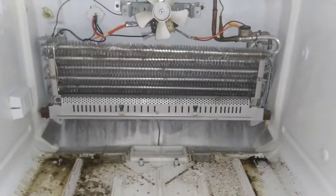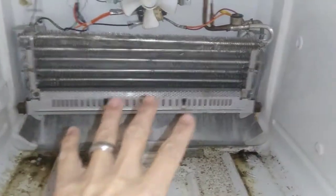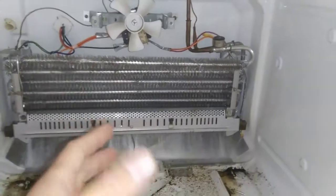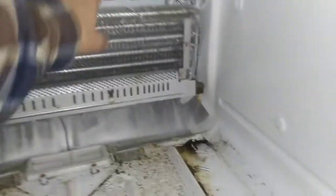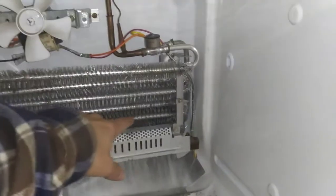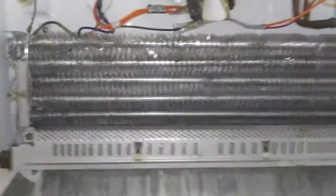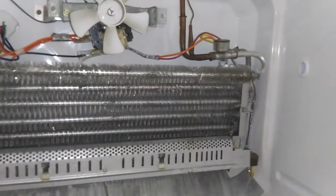If this thing can hold 100 PSI for 24 hours with this AL-822 rod, I would call it a good repair. I'm kind of past thinking that this evaporator has had a leak. I'm going to test it anyway to see if maybe there's one in between these here. These evaporators don't usually break there — a lot of times it's at these joints and in the curves. This isn't the best example to use, but it's what I've got.